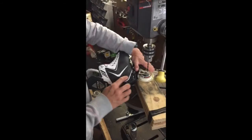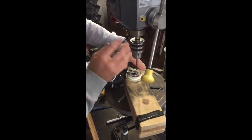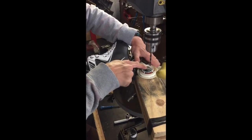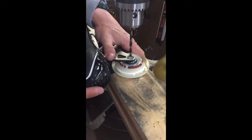One of the questions we get asked every once in a while is how do you get out a stripped bolt. The key is to find a drill — we have a drill press here, or you can use a handheld drill. You want to hit directly in the center of the axle bolt on the side that's opposite of where you would put your allen key. So what we do is we line this up and make sure it's centered.